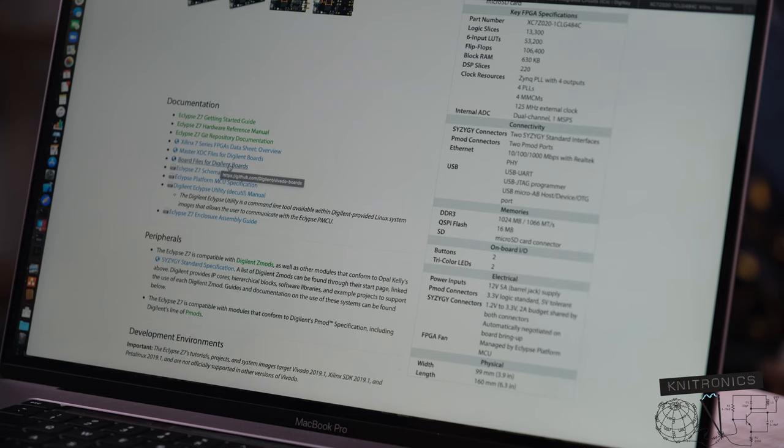The board files are what you install in Vivado's base directory such that when you create a new project, that's when you can go to the board tab and actually say this project is targeting the Eclipse Z7 board. And it will import a lot of those board presets for you when you add the Zynq IP block into your block design in Vivado. The block automation will come up and say 'apply board presets,' which will enable all of the peripherals for you already.